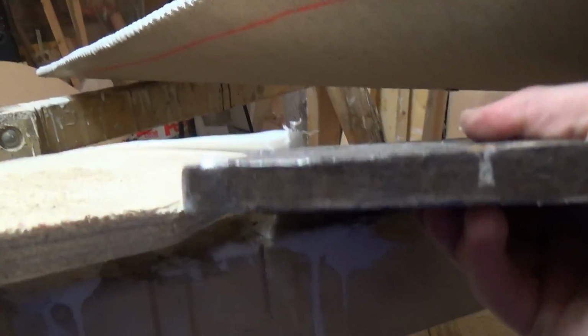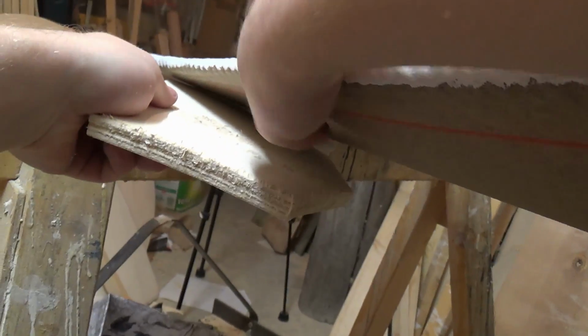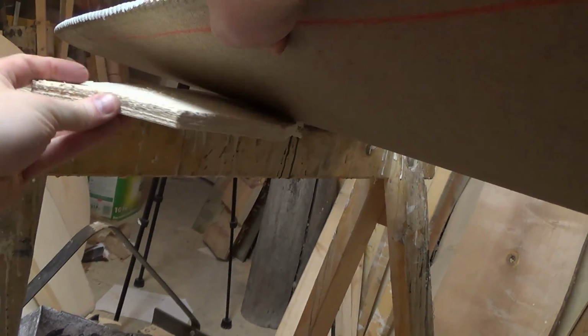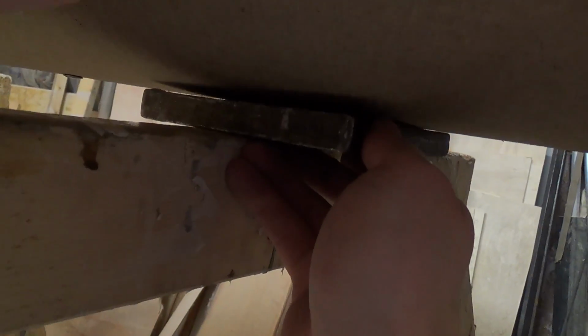The shield basically has the size of a dining table, and that's why I need a special setup in order to hammer the rivets correctly. In order to do that, I put a thick piece of metal beneath the rivets and one of scrap wood of equal thickness on the other supporting point to get the correct angle. Now we can finally start.